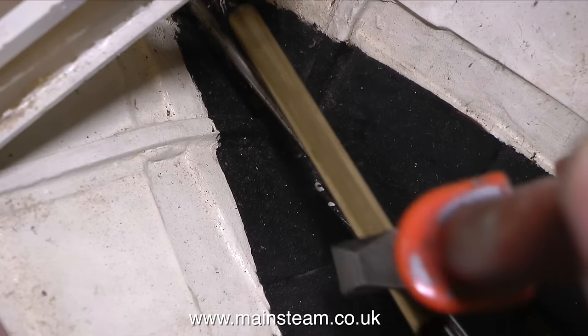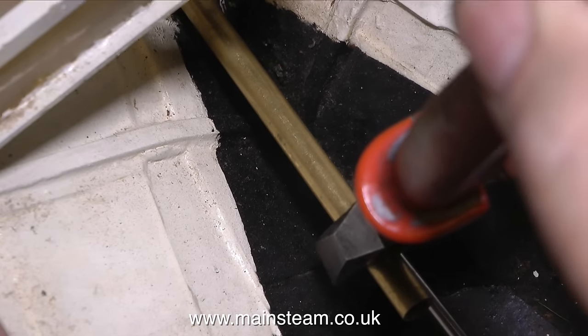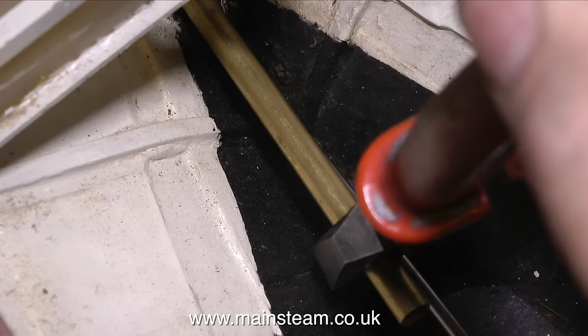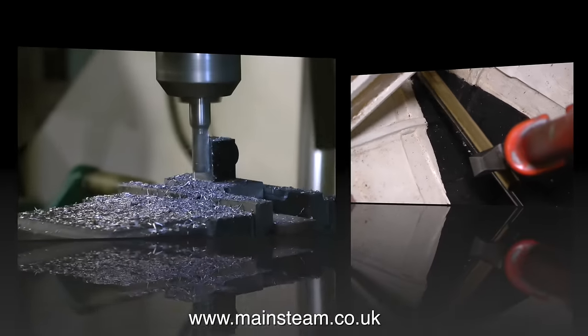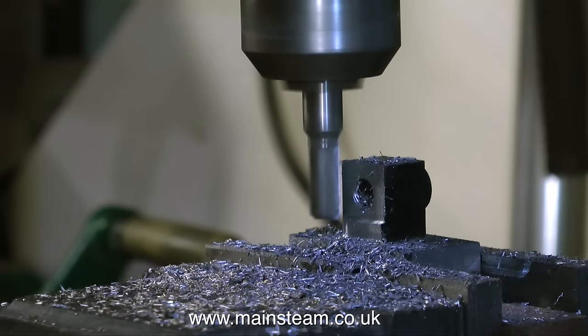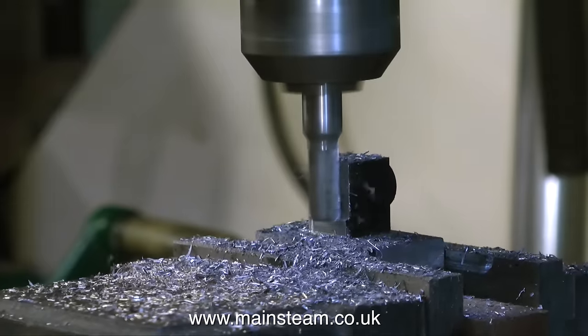Having a look at this, I was originally going to do a major modification — I was going to fit a brass tube like this with phosphor bronze bearings in each end, permanently fix the tube in place with copious amounts of milliput epoxy putty. Moving the camera over to the milling machine, you can now see the milling operation.